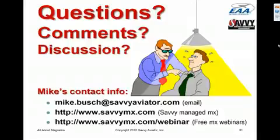Wow. Well, I have to admit, Charlie, that I have never worked on an A65, so I guess I need to do a little homework. But I know it's a little low on your horsepower range. Well, it's just hard to imagine that a non-impulse coupling mag could generate enough voltage to start the engine at hand propping speeds. But I could be wrong. I'll check it out for you.